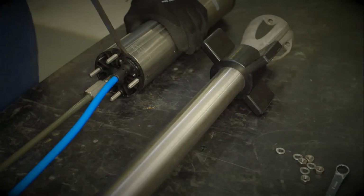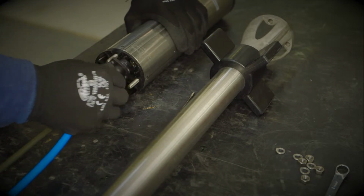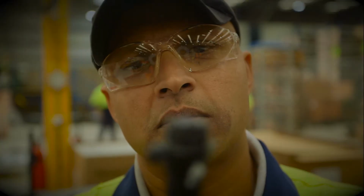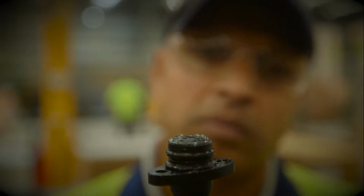If the motor fails the test, you'll need to remove the motor's electrical lead. When doing so, inspect the plug and socket for any signs of damage. Mono also recommends checking the integrity of the lead by performing the same earth leakage test, just on the leads. If you're replacing it with a new motor, we recommend replacing the O-rings and the plug at minimum, and preferably the entire lead.